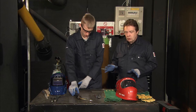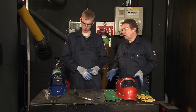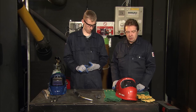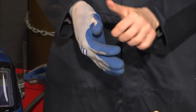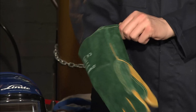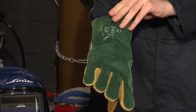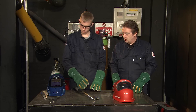Make sure that there's no combustible materials on the bench or around it. Safety first, and bear in mind that everything in this area is hot. Okay, so we'll change our gloves, put our welding gauntlets on, and make sure that your sleeves are tucked well inside the gloves. And now your welding screen.